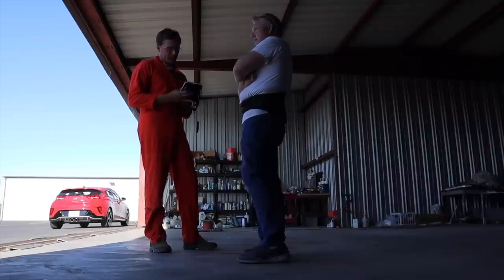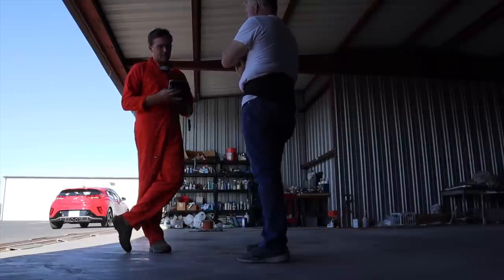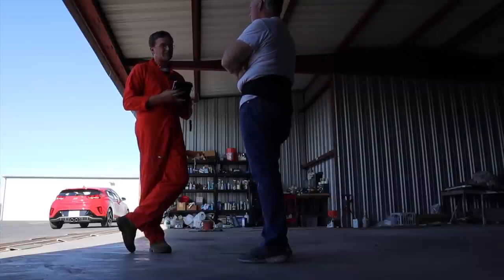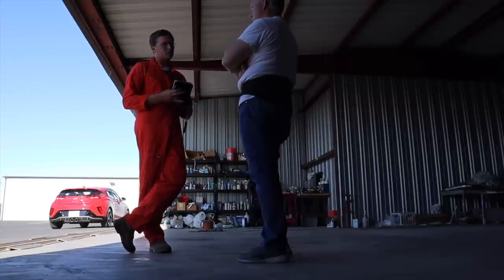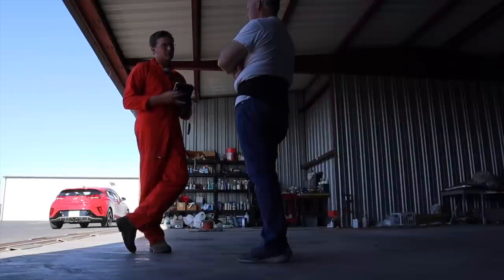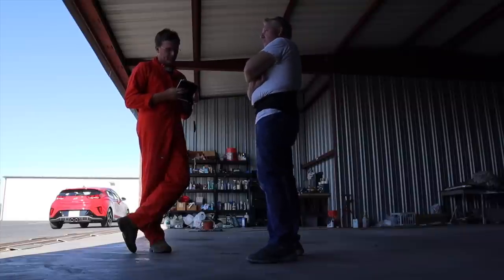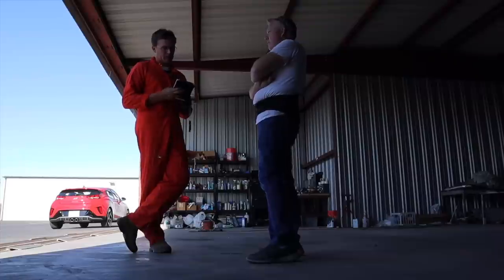What power setting was that? Initially I was able to get it at 15, but there was a slight descent that I didn't catch, so I think it's probably like 17 inches. So it's 15 on the first and 18 on the second, and I think it's probably somewhere in the middle, closer to 18. Was that 60% of power or something? I have to look it up. I would call it 17 inches at 2,500. What fuel flow did you get? That was like 12, I think.